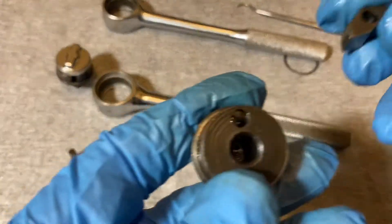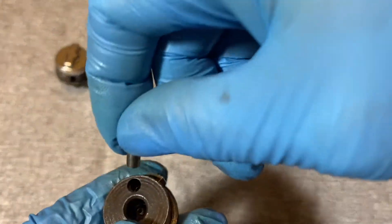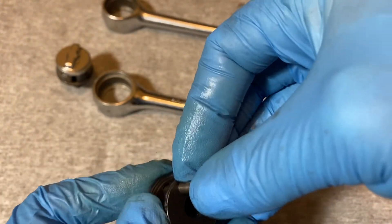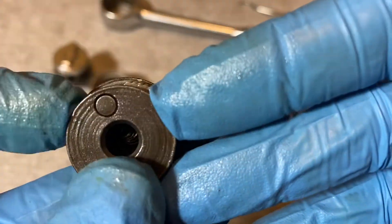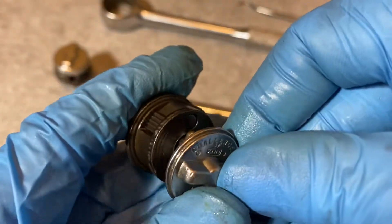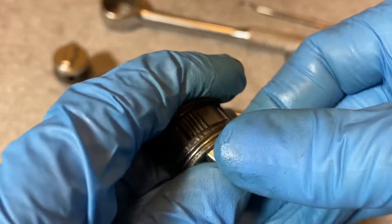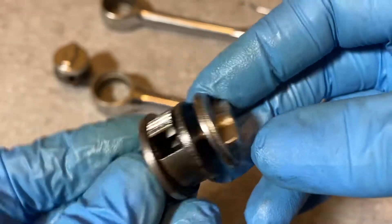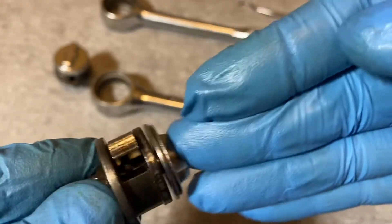To get this back together it's pretty simple: you just put your pawl there, position the pin in the hole for the pawl like that. Take your switch and plunger and press it in with your finger. There it is — it rocks back and forth, and it's spring loaded. I don't know exactly why they did that, but they have that feature.